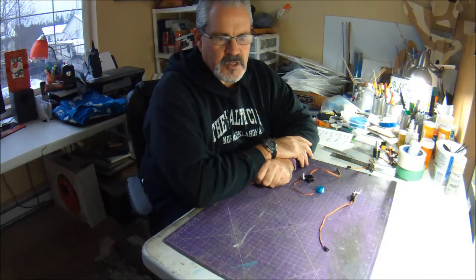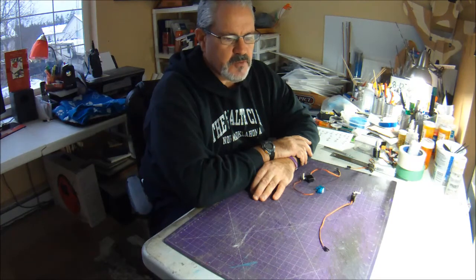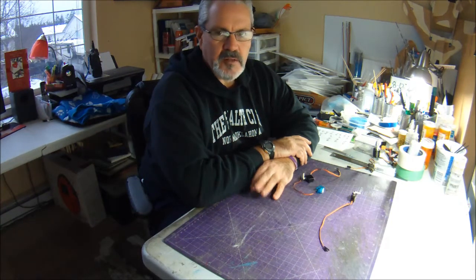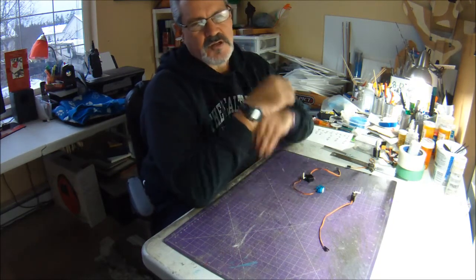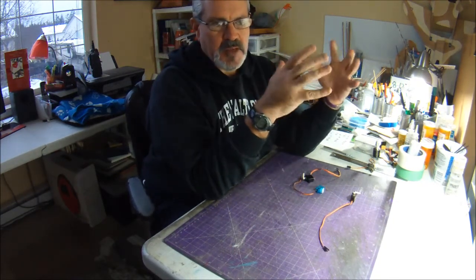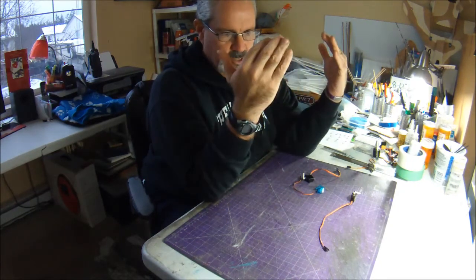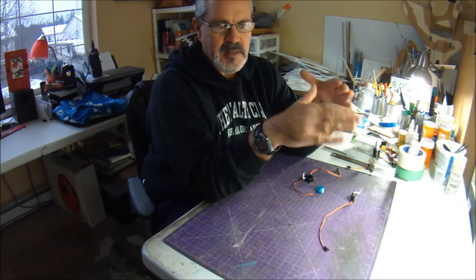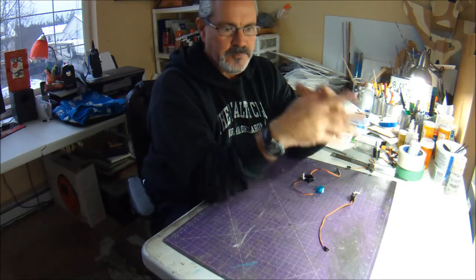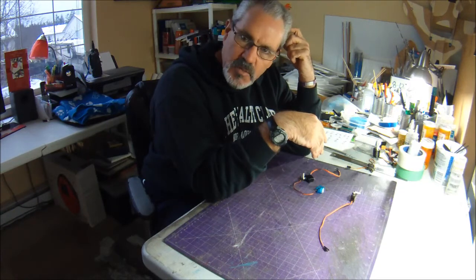And then about 3 years ago, I changed my whole philosophy on flying. I started focusing on flying my planes in a more scale manner, so I watched lots of videos of the real planes flying, and then at the field I tried to emulate or mimic pitch rates, roll rates, turn rates, that sort of stuff. In order to fly smooth and precisely, I really needed to bring my throws down considerably, and I also started working towards reducing my expo quite a bit.